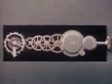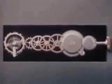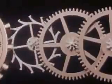Each swing unlocks the escape wheel so it can give an extra push to a pallet jewel, keeping the watch ticking far more steadily than any beating heart. All we have to do now to measure time is count the ticks, but this would be a tedious job and not very practical. Just as we needed a dial on our water clock, here too we need a method for recording the flow of power. So to the shaft of this gear or wheel we add an indicating hand to measure seconds.